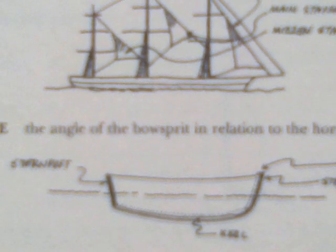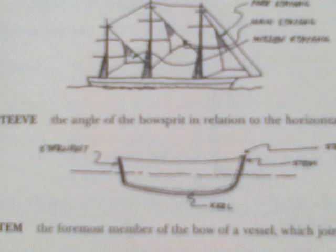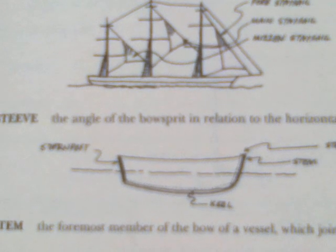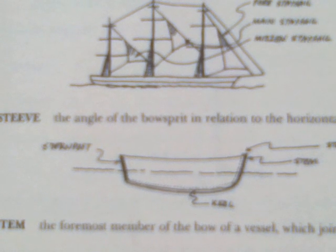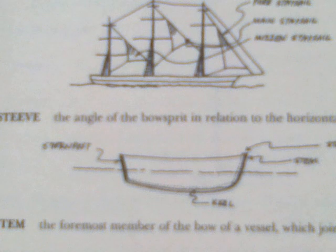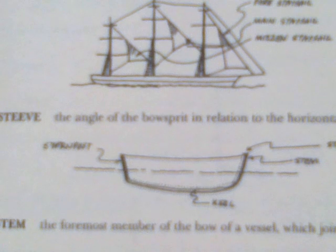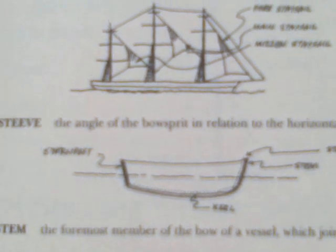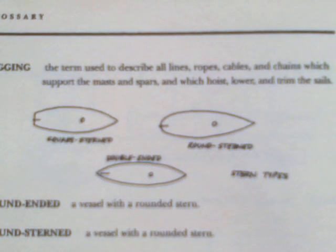Broadly speaking, if we're talking about a single-hulled, multi-masted ship, it won't have any extra special keel, retractable or fixed, sticking down underneath it, because there's enough of it poking down into the water that if the wind blows on the sails and tries to push the boat sideways, there's enough side area under the water that it's easier for the boat to go forward or backward, and the hull is shaped, cunningly artificed, in such a way that it's easier for the boat to go forward rather than backward.